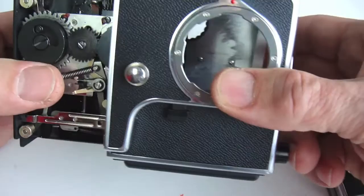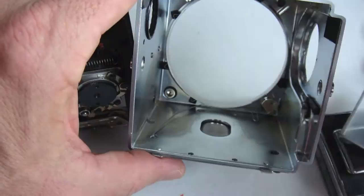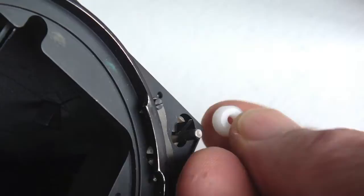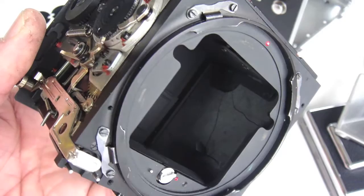It is now time for the mechanism to be slid out of the box — it is really just that easy. Using tweezers, remove the two bushings that serve as spacers on the inside of the box. Then remove the nylon bushing from the lens release post. Note the orientation of the taper. As needed, inspect, tinker, tweak, and clean.